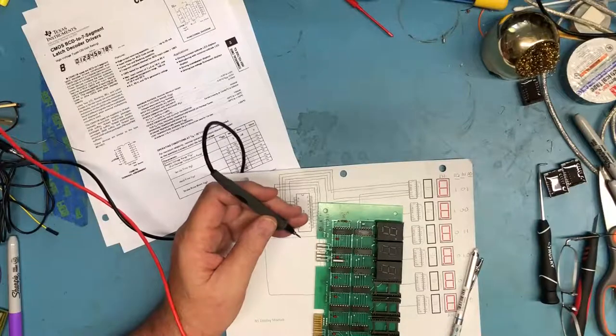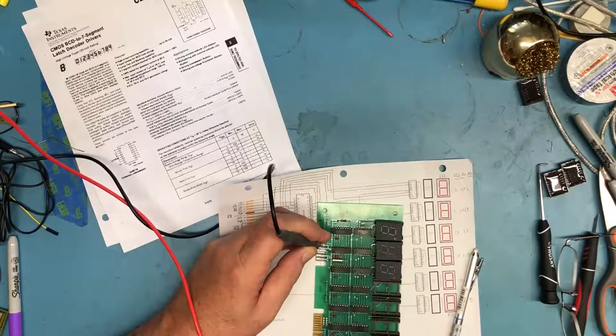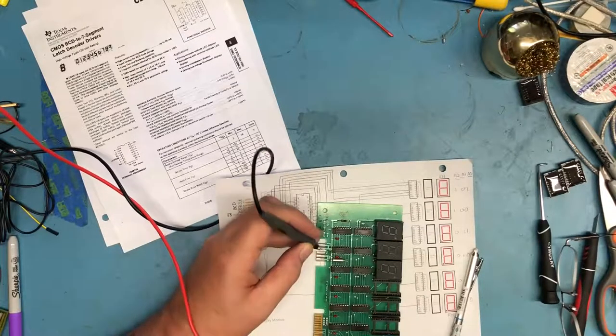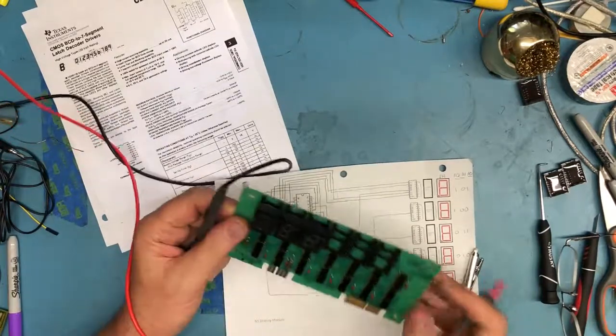That's strange. So, am I seeing the internal pull up in the device? That seems low for that 653 ohms. That would certainly pull it high. What do I see if I hit the ground? 1.8K. That's kind of a mystery.